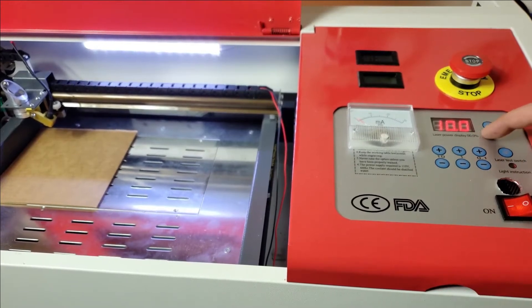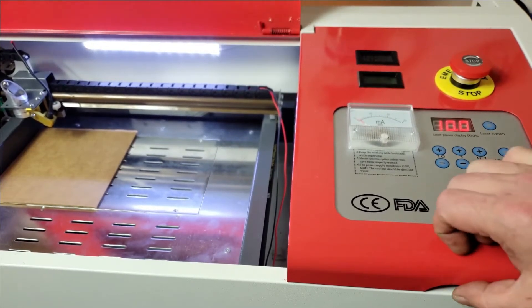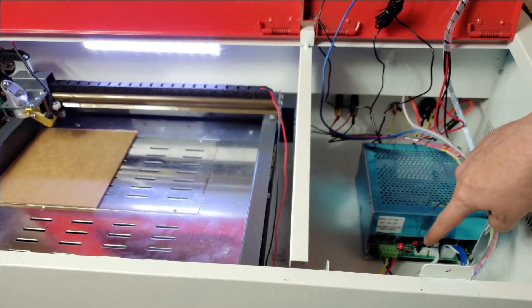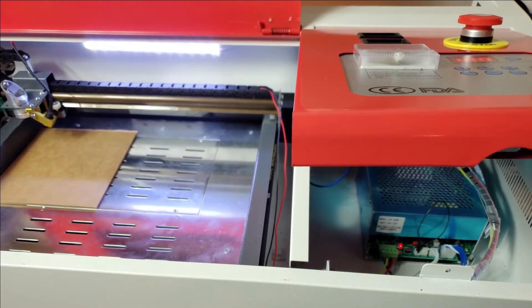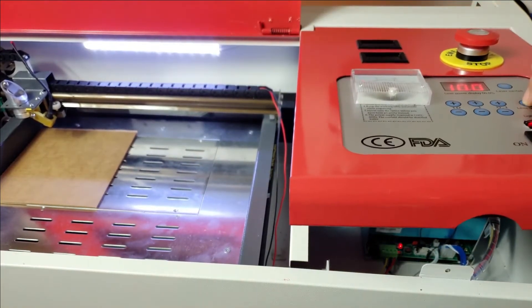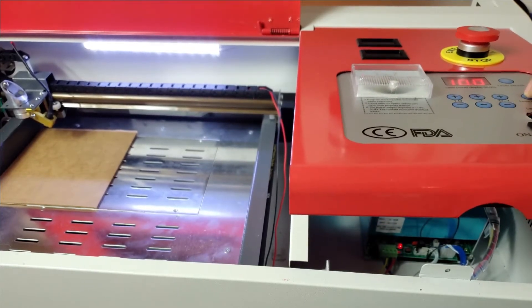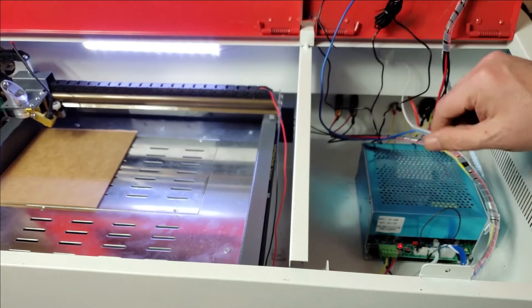If you have the other style with the knob and a push button for the laser on-off switch, the other switch has wires coming out of it. Instead of tying into where I'm tying into the power supply, you can tie into that line right there and do basically the same thing. By default, this comes jumped — I just put a jumper cable in to show you. With this jump in place and you test fire the laser, it fires no problem. If you pull the jump, you break the circuit, try it again, the laser won't fire. The light's coming on, it's trying to fire, it's saying it's going to fire, but it's not. So basically we're going to put the switch in here so that if that's open, the circuit's open and the thing won't fire.